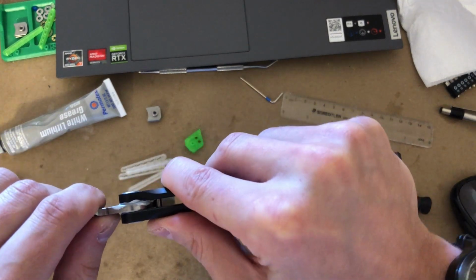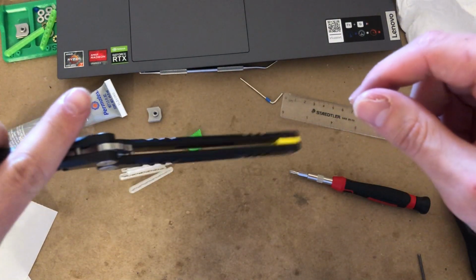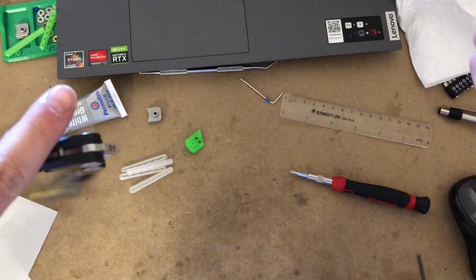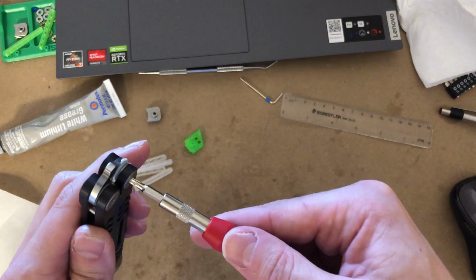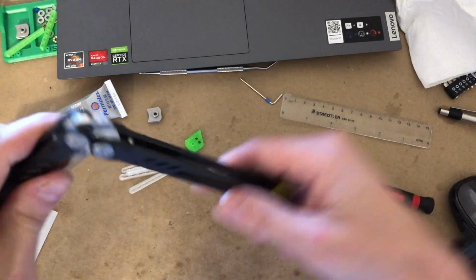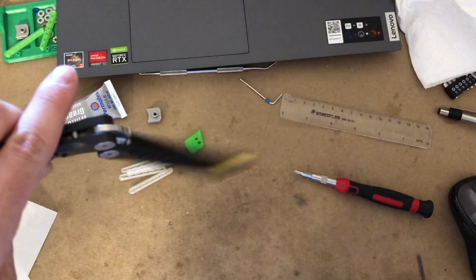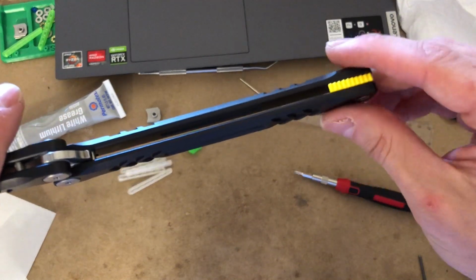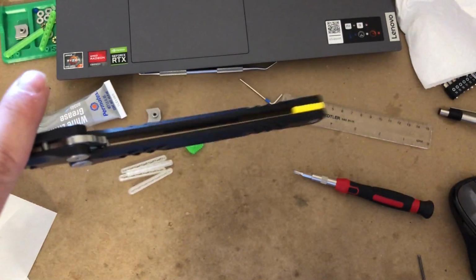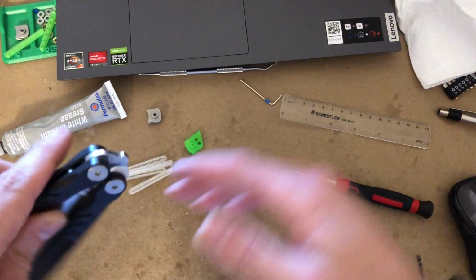If you have any handle wiggle, I like to tighten that out. And this feels pretty good. I'm gonna loosen it a little bit more. And that feels really smooth to me. It's a lot slower. Let me see if I can reproduce it. If I didn't have the lithium grease, it would swing like really fast. With the lithium grease, it's a lot slower, more controlled.